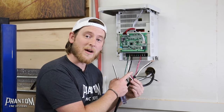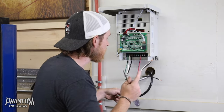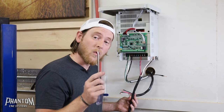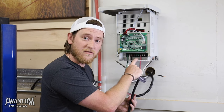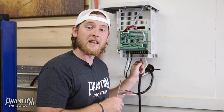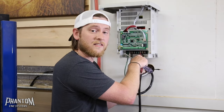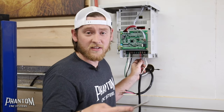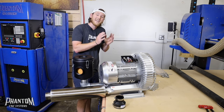The most important thing — and I keep reiterating this — is to get your wiring correct when going from the VFD to the vac pump. What I recommend is doing one wire at a time. On my U setting I have my red wire, so I'm going to do red on the VFD to the U line, then go to my pump and wire up the red there. Now that I've hooked up the U line — the red wire — from the U on the pump to the U on the VFD, I'll repeat it for the black wire: black to V to V, and repeat again for the W. So UVW matches UVW — it's a good way of making sure everything is the way it should be. Now that all the electrical is hooked up with U to U, V to V, and W to W, we want to test it and make sure everything's right.